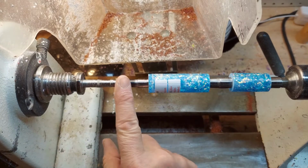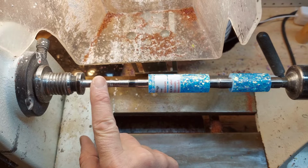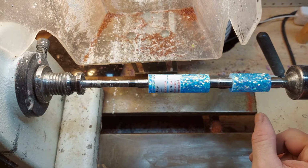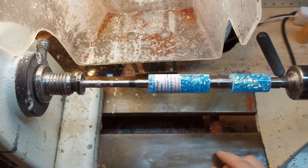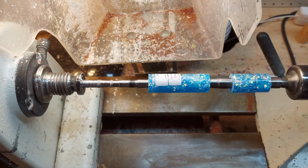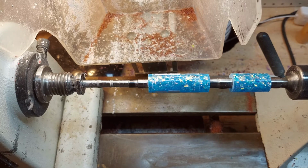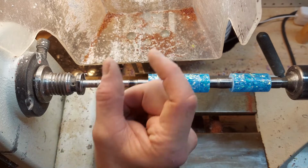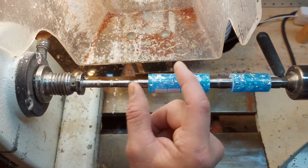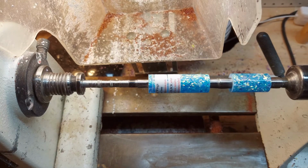These are spacer bushings, by the way. They're just 7mm bushings used for turning slim lines. We use them as spacers. By rights, I really should take one out. I'm close to the end. But what's the advantage of using this setup? The advantage is you can do both barrels at once. Even more so if you have aromatherapy necklaces, which are really short. And if you have 3 sets of bushings, you could do 3 aromatherapy necklaces at the same time.